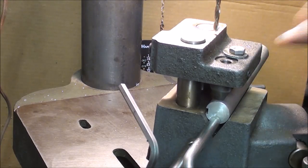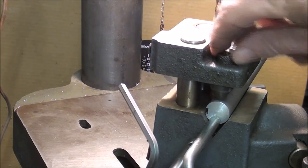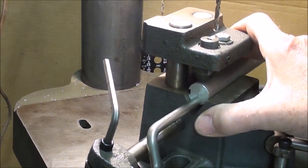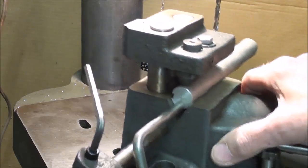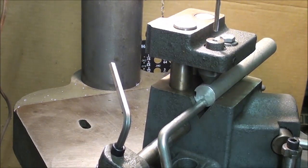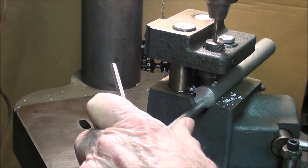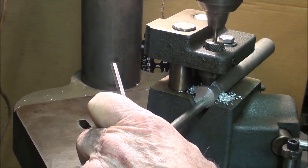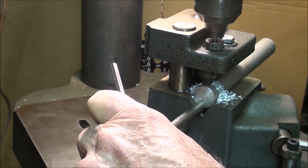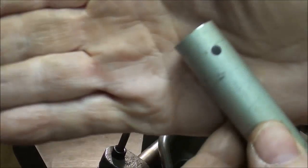I'm over at the drill press now. This is three-quarter stock locked in place and there's a five thirty-second drill bit — I'm just arbitrarily choosing that size. Now I like to move this around in the smaller sizes, but in a larger size you really need to clamp this down. If you're drilling half a million holes you would take the time to bolt it down. You can use oil or whatever you want — this is just aluminum so I'm going to do it dry. And this will produce a perfectly accurately located cross hole. I like to back off a little bit and clear those chips. Now how sweet is that?